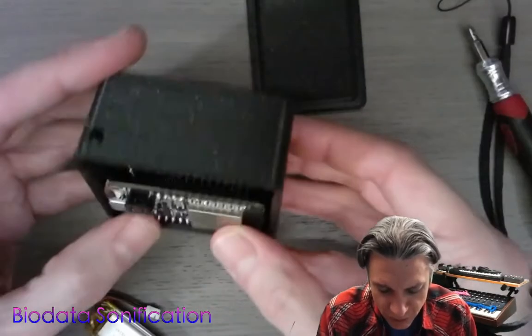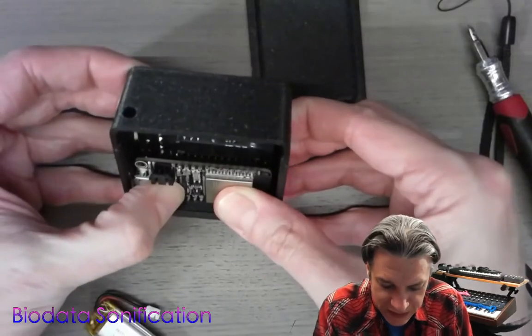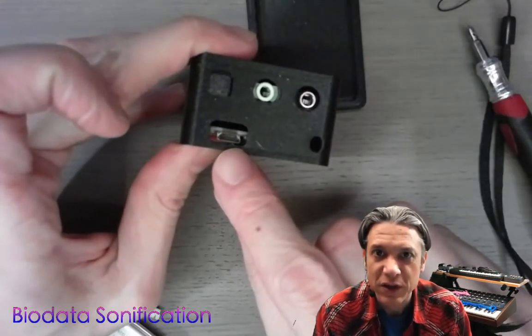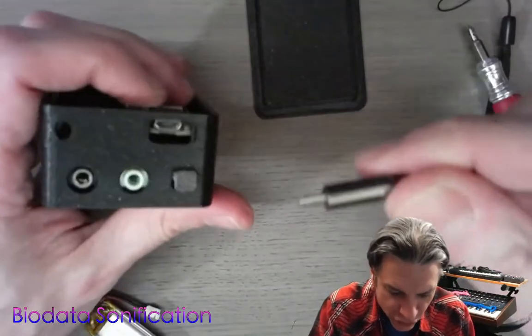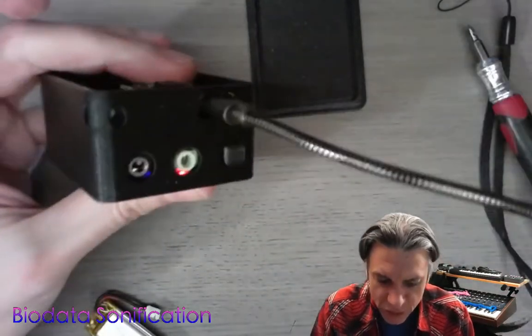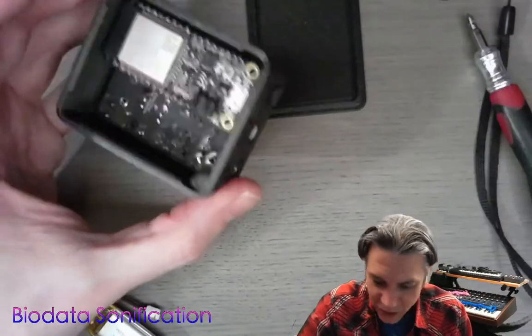You can even use the long headers with this circuit board design. You need to line up the pins of your ESP32 and then press it down evenly. The USB socket is visible, so I'll bring over my USB cable to make sure that it plugs in appropriately through the hole — and it does, and everything lights up. So now I'll unplug that.